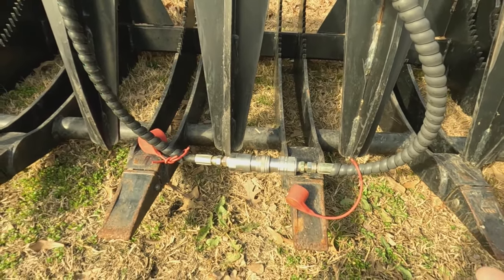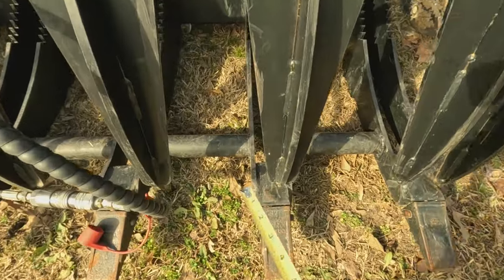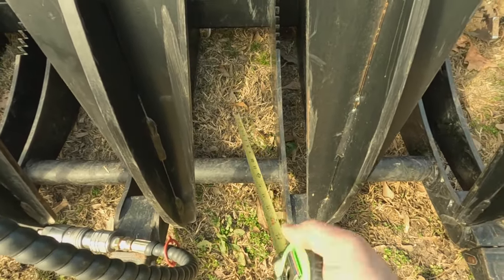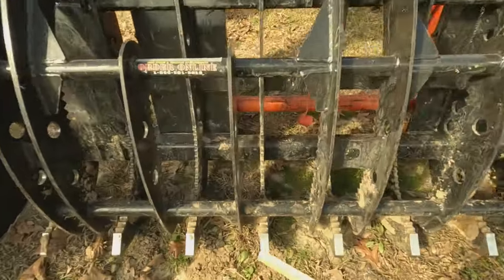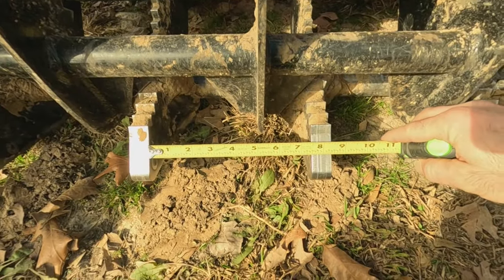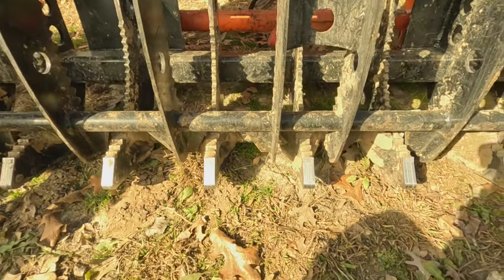Moving piles, things like that, where you have a big pile to grab onto, it works okay. But you do get a lot of small stuff that falls out through these gaps and falls back down on the ground. You have to come back and try to pick it up, and this one doesn't pick up small stuff very well at all. Over to the EA, there's about 7.5 inches between the ends of these tines, so you're raking up smaller stuff a lot better.